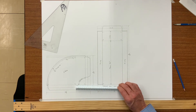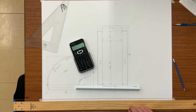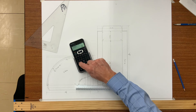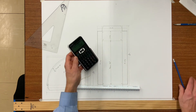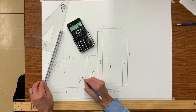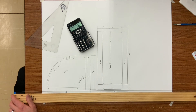Let's go ahead and figure out the throat mathematically. Here it states that the working line radius is 1 and a half. Therefore I'm using 1.5 times 1.57, which is half of pi, equals 2.35 — in fractions that would be 2 and 3 eighths. I also have to add for my connectors, which is 1 inch on both ends. Therefore my cut size is 4 and 3 eighths by 6.